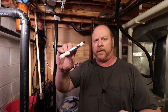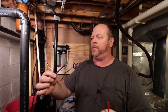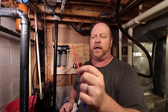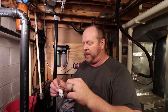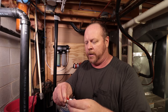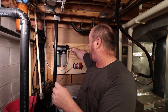The Stealth 150 comes with another device — a bypass valve — used to send some water down the drain prior to going to the system. It comes with a purple and a red hose. If your water is over 300 parts per million, they say to use the red hose; if it's under 300, use the other. Basically this is a one-to-one outlet and the red is a two-to-one outlet, so with the red hose installed I should get two gallons of waste for every one gallon of product water. I'll go ahead and install that one — it goes in between the outlet of the filters and the membrane.